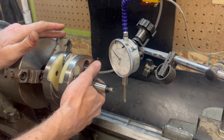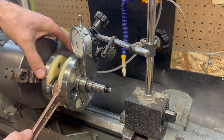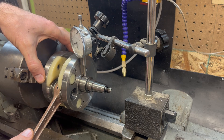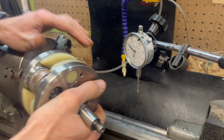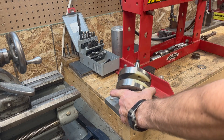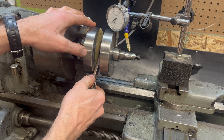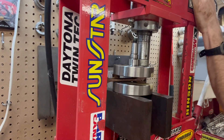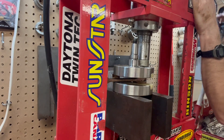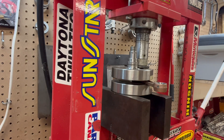I do it this way because it's easier to measure the swing of the crank than if I were to hold it in a set of V-blocks. To measure what I'm calling the swing on the crank, I'm going to be placing the big end of the rod at the front and at the back. In this case I'm what I call front side high — when the bearing is at the front side of the lathe, I've got a high measurement. At this point the crank is moving really easily, so I want to get it within 10 thou and then I'll keep pressing. I'm going to check the true in the lathe a couple more times before I get my final measurement, which will make my final true easier and give me a better crank. Often times getting the final crank width is the most difficult part by far.